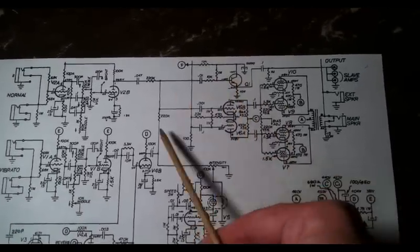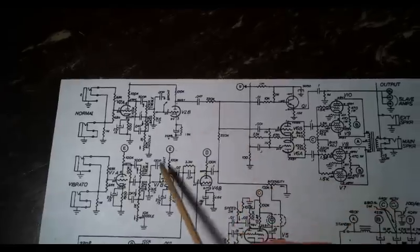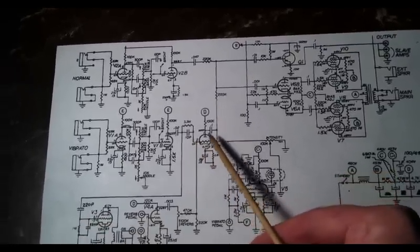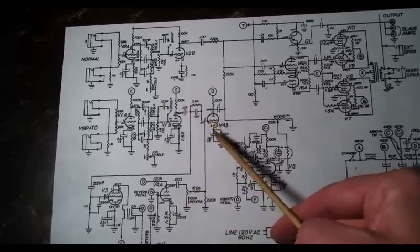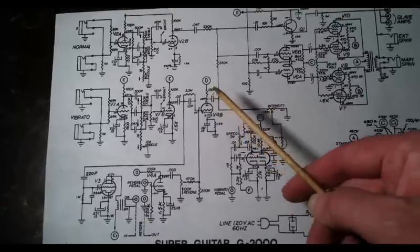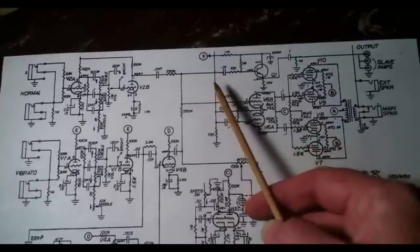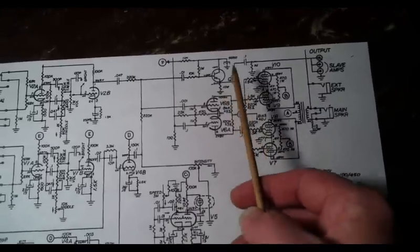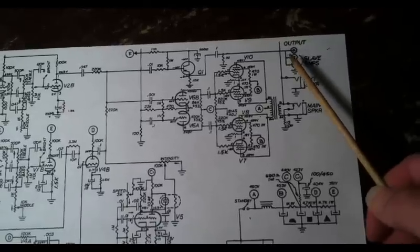And essentially what that is, that's the point in the circuit where our channel 1, our normal channel, comes through. Right here, our second vibrato channel also comes through and hooks up at this point, as well as our reverb. Our tremolo also, here's our intensity for tremolo, it's also hooking in at this point. So pretty much everything is being mixed together right here. Here's our mix, and it is coming out of this little transistor on this design and going to the output for our slave amps. So there's our slave amps output.